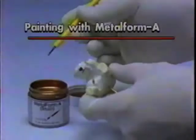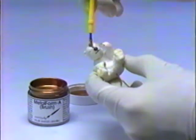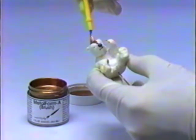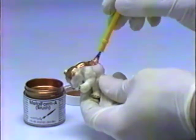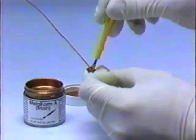Painting. Using a clean, soft paint brush for acrylics suited to the type of part, simply apply Metalform A wherever you need it. If paint is too thick, you may dilute it slightly with water, making small additions and testing consistency often. This paint thins very easily. Make sure to coat the base of the plating wire and the entire part as evenly as possible to ensure continuity.